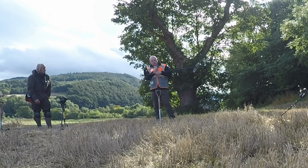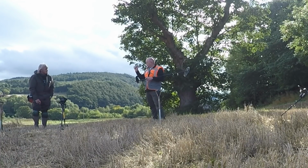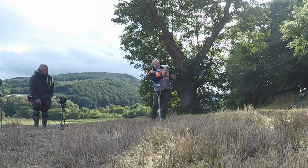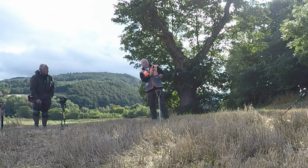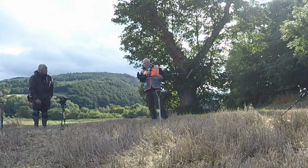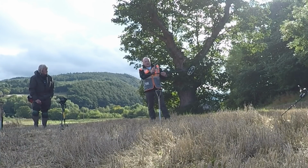When you're on the tones, if you do the long press there, you're then into your tone breaks. Now all this is doing is adjusting the target zones that you want to hear. So in essence, I could turn that all the way up and down. Wait a minute, no, sorry, that's my volumes. So my individual volumes there, I can put them up and down in that secondary function screen. And again, the accept reject button changes it between T1, T2, T3, T4 and T5, assuming you're on 5 tone.